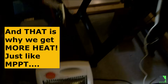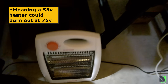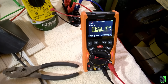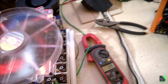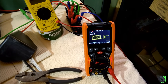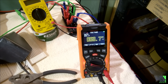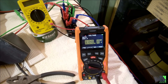And just to be clear, my heater is still running, but it's being overvolted. So I need to hook the diodes back up again. Clearly, the diodes are able to hold the correct voltage — they're regulating automatically, without any sophisticated electronics, at 63 volts. Really, 61 volts would be fine, 62 volts would be fine. It's not that critical to match the exact voltage — it's just a range. Once I get into this range, I know I'm getting pretty much the maximum amount of heat I can get out of my solar panels.